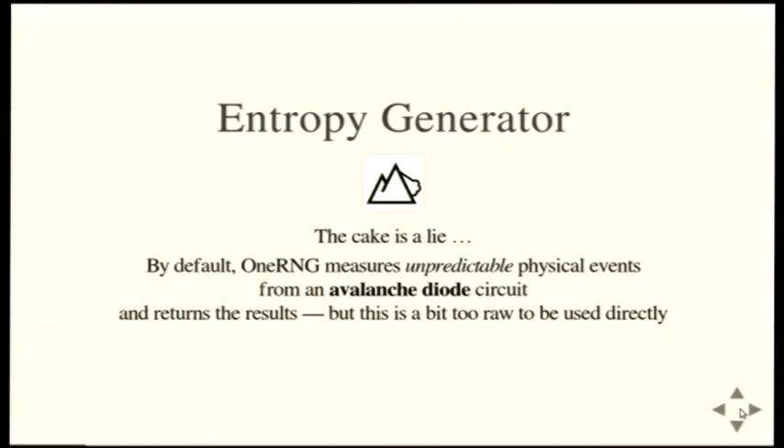So what we're doing - we've got a great project name, one random number generator, but actually we're not generating random numbers. We're generating entropy, which you then use to generate random numbers with. We use the unpredictability of physics - here's an avalanche diode circuit. If you get two diodes, you point them back to back where they shouldn't work, keep increasing the pressure on them and wait. Depending on quantum mechanics and temperature effects, suddenly you'll get a pulse out of the circuit. You just don't know when. We don't know enough about physics to know when. Therefore it's unpredictable. Temperature-related effects will change things, but we still can't actually predict what it's going to do.